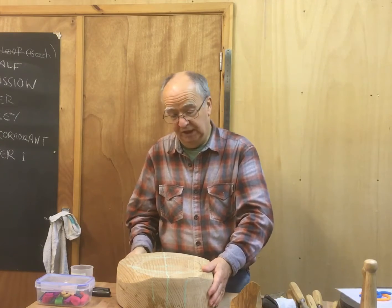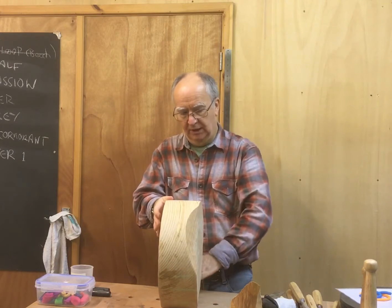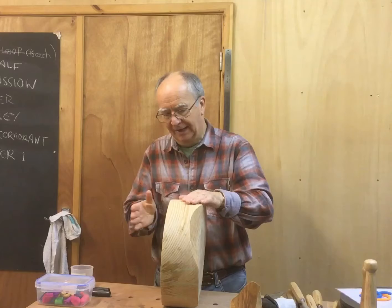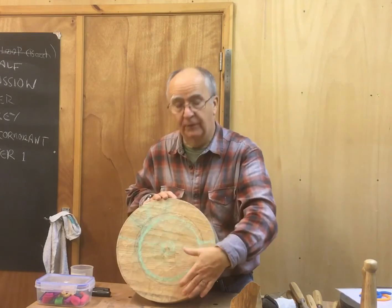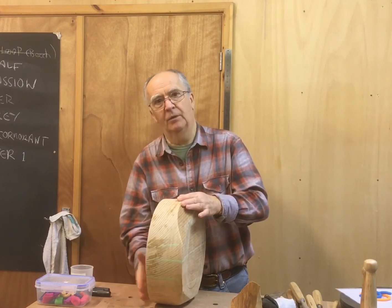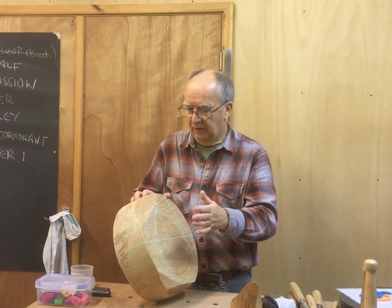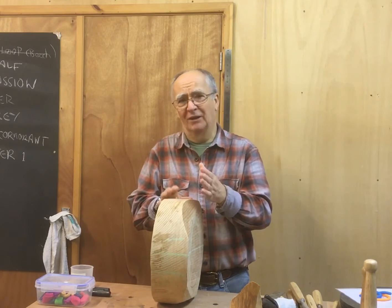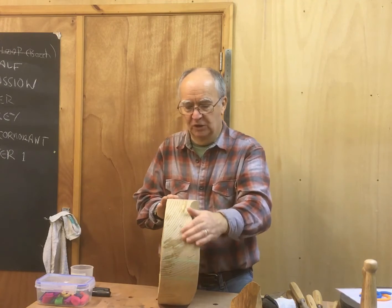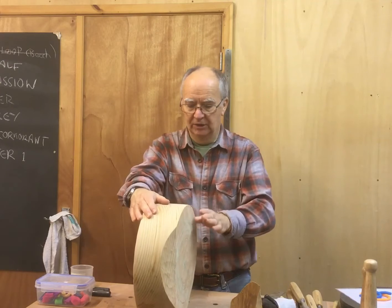And then to get it really circular, I put it on a lathe. So this surface, all the way around, has been made into a very accurate circular cylinder. I haven't turned any of the wood on the lathe off either of the two surfaces, because there's slightly more depth down here, and there are these pieces where it's cut away at the moment on this side, and I didn't want to keep shrinking it down on the lathe. There's always a danger with a lathe, because you can make things look terribly neat, that you get carried away and then you end up with a rather small piece of wood. So I stopped myself as soon as I'd got this accurately round, and I've sanded it very, very slightly just to get it a little bit smoother.